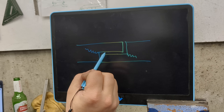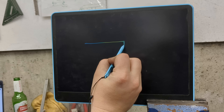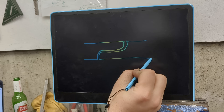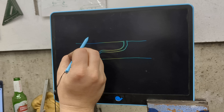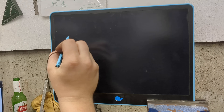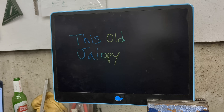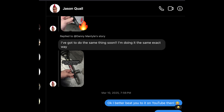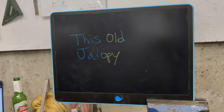All the stresses are focused at that one point. And so now we've come to my design — the same sort of lap joint, but with rounded inside corners. This will evenly distribute the stresses, so cracks should not form. Like all the designs, there is a sleeve holding it all together. Admittedly I'm probably being a little too cocky, especially for someone with no professional experience in any of this. But at least it's better than what those men in flip-flops are doing on TikTok, and I got a vote of confidence from tinkering guy. I'm fairly certain this is the best way to join the axle shafts.